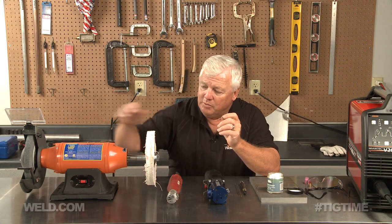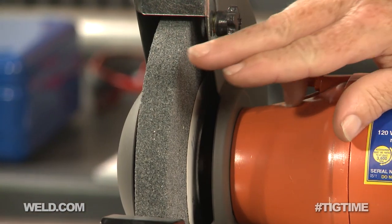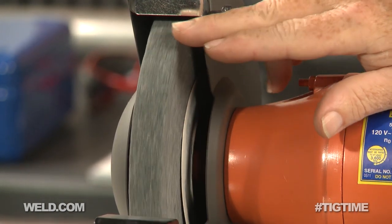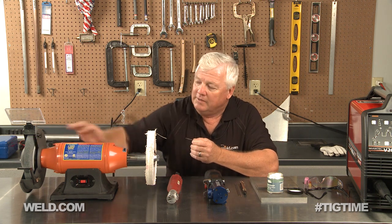Let's get started with this one right here. This is a pedestal grinder that just about everybody has in their garage. This can be purchased at any of the economy stores for about $50 or less. Should you use a grinding wheel? Yes, it's used frequently. If you'll notice the wheel on this, it's got probably a 60-grit wheel. Can we grind with it? Yes. I prefer to put a 120-grit wheel on there, but you can get good results even with this. It's a really good idea to make sure that wheel is used for tungsten grinding only — you don't want other metals or soft metals in there, or you may get some contamination on the end of your tungsten.